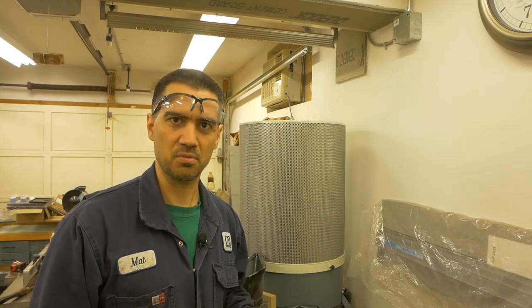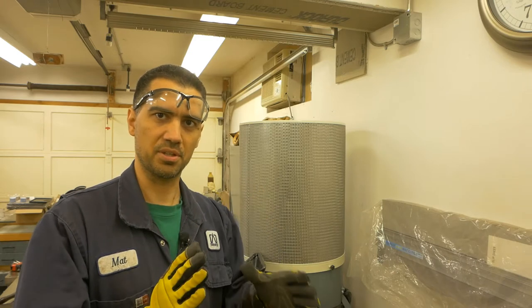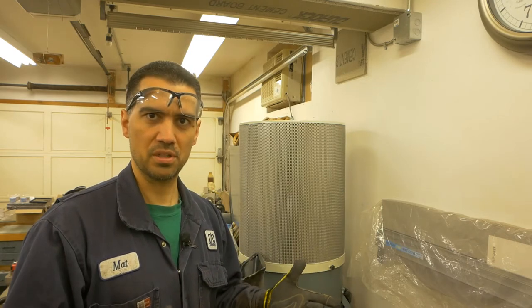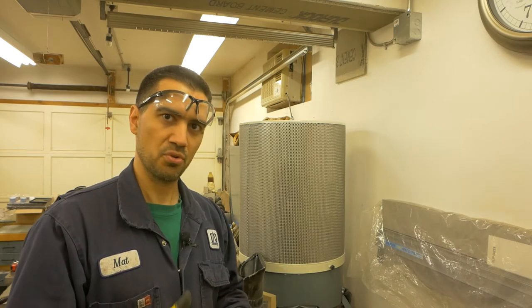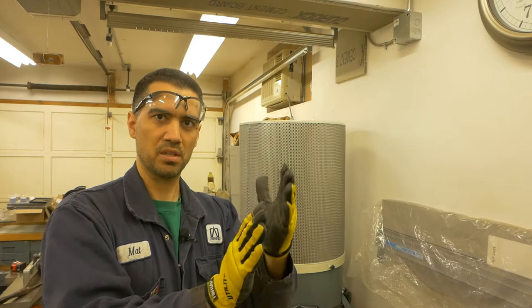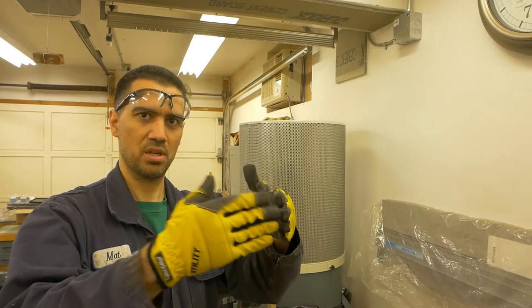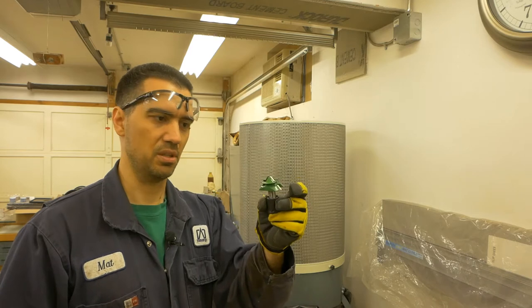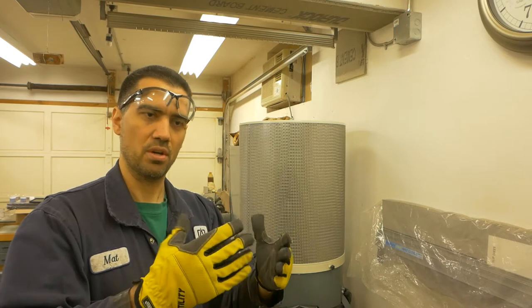As you remember from one of my previous videos, when I was explaining the challenges I'm facing in one of my selling locations, the new display cabinet that I wanted to build contained tapered legs, and of course the wood that I need is very thick for that one. One way to do it is to splurge money on the really thick wood, which is also low in supply. Number two is to get pieces of wood and glue them together to get to that thickness that I need. And number three is to get pieces together and glue them to make a hollow leg. So this 45 degree lock mitre bit is perfect for this, so that it creates a nice 45 degree angle and there is no sight of a joint.